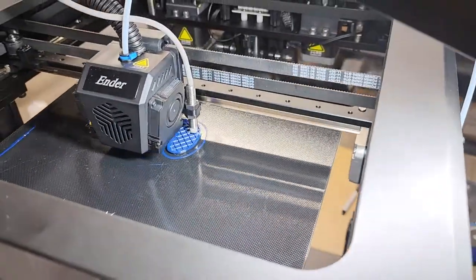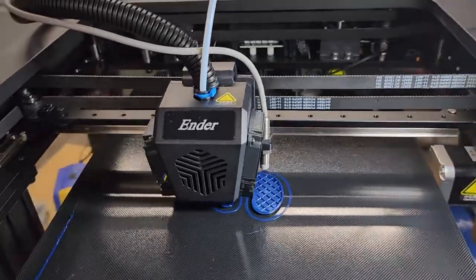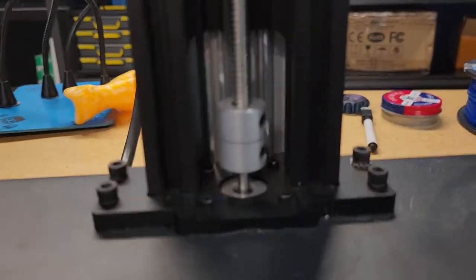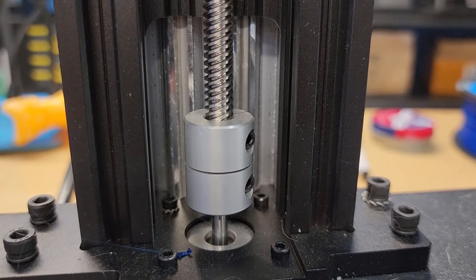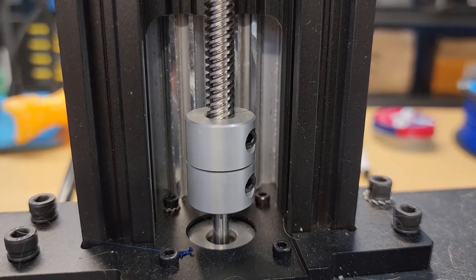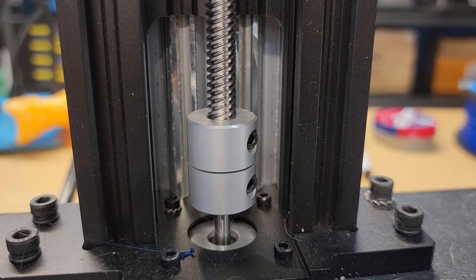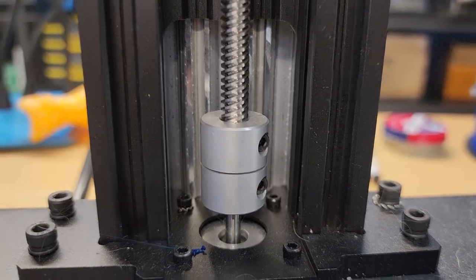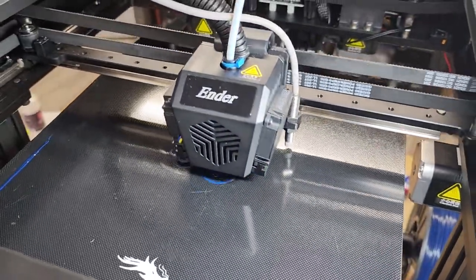You can see we're printing just fine. We got our firmware on here — this is Unified 251 that I just pushed out. If we look at our Z-lead screw here, you can see that it is slightly moving. It's probably hard to see in the video, but the Z-axis is compensating, which means our bed leveling system is working. You can see we do have a nice first layer on the skirt there.